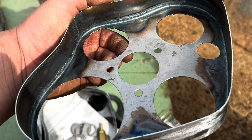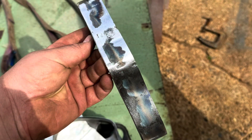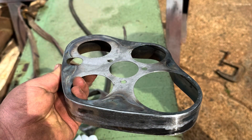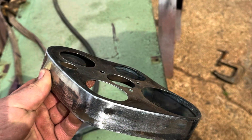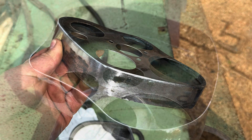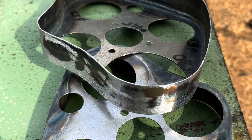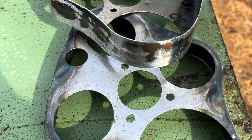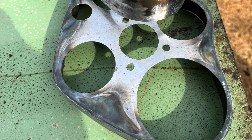Here's some different work we've completed this week — these are instrument cluster panels for an early 20th century Matchless motorcycle. This job was given to us by our friend Pat, who is a Matchless enthusiast. These clusters were made from about 1.2–1.5 mm thick CR4 mild steel, which is very formable. The former and patterns actually came from Latvia from a friend of Pat's.